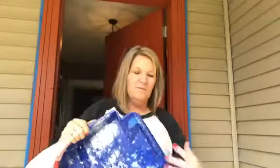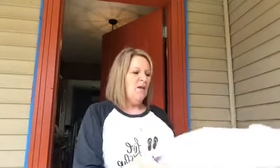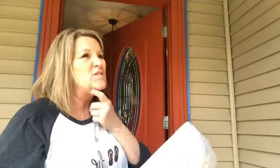What I wanted to show you first - if you don't know this trick - I take a paint pan and stick it down into a tall kitchen trash bag. We tie a knot. This is always such a good trick and everybody's always impressed when we're on a job. Then we put in the pan, but it's full of air, so we just rip a little hole in the back. Your paint will lay right in there. When we're done, if we're coming back the next day, we untie the knot, bring the bag up over top, and tie it off. You're good to go for the next day without having to wash out your big roller. Small little three-inch rollers and brushes we always wash those out.